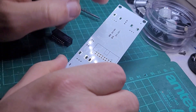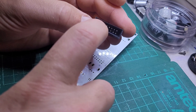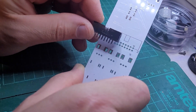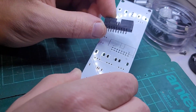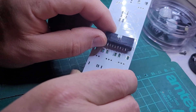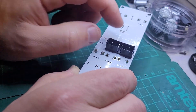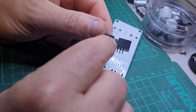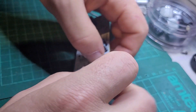The first thing I recommend is to install the IDC connector. This is a 16-pin connector — two rows of eight pins. If you have an angled connector, the notch needs to be on top. If you have a straight one — and I actually recommend straight ones to take less space — just align them with the notch on top, then flip them over. Pin one is always the first one to the left of that opening. So place this connector here, matching pin one, and then we're going to solder that.